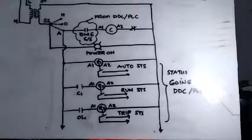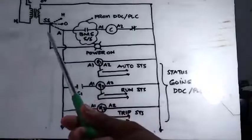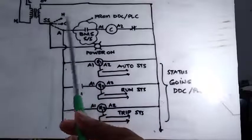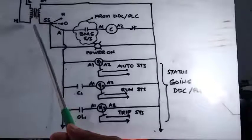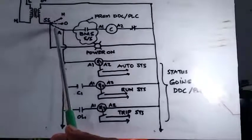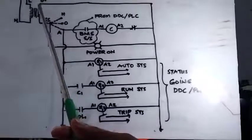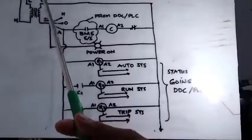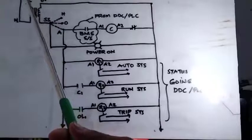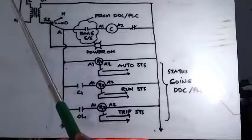Today I'm going to discuss my control wiring diagram in automatic position. As you can see, I have my simple motor control in auto position. I have my secondary side of my control transformer and my selector switch. I am now connected in auto, represented by A. In my previous tutorial, I already explained the manual control, so the selector switch should be in the hand position. The manual control wiring will be intact, so we will not do any big changes there.